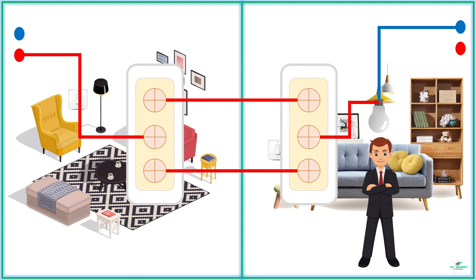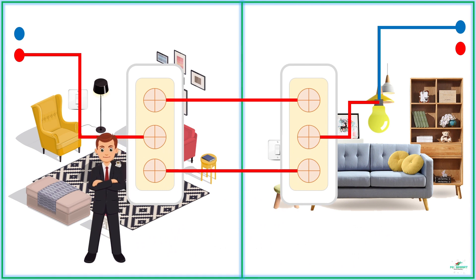That's all with the wiring. When one switch is kept at the down position, switching the other switch to the same position will close the circuit, as you see on screen. This allows current to flow to the load and the load turns on. If the person moves to the other place where the second switch is placed and turns the switch to the opposite position, the circuit opens, as you see on screen, and the load turns off.